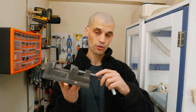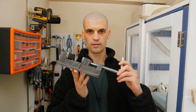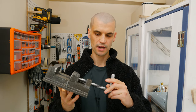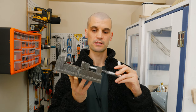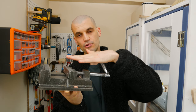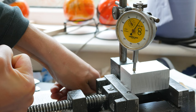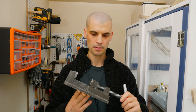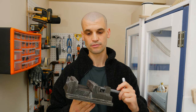The last thing that goes on the CNC is a vice. I bought one off eBay labelled as a CNC vice, but it's actually just a drill press vice. The problem is that when you clamp your part in tightly, the moving jaw raises up slightly, which causes your part to raise up slightly. If you're not worried about accuracy or parts fitting together that might not matter — but it really does annoy me. Every time I clamp up, I know the part is raising and there's not much I can do about it.